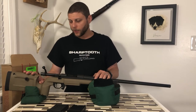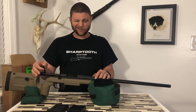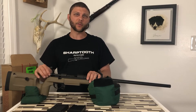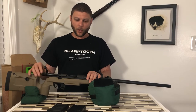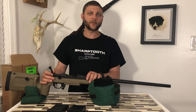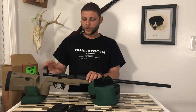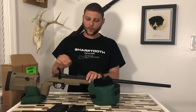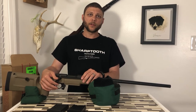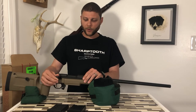Pretty neat rifle here. Some of the things I intend to do — we talked about adding the spacer at the back. I will also put a very mild lapping compound in the action to help smooth it out. Actions will naturally smooth themselves out, but that can take a thousand or so cocking and decocking cycles and sliding that bolt in and out of the receiver. So putting a little compound in there will help speed that up. We'll also lap the face of the bolt, which will make for a nice, tight, square lockup inside the receiver with the locking lugs on the bolt. We'll do a separate video to show you that process.